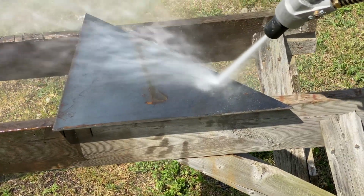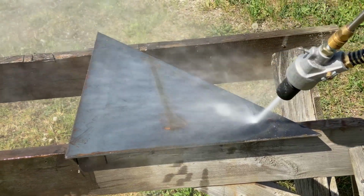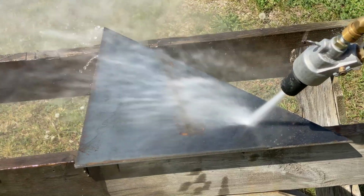So the abrasive particles get mixed with the water, delivering more abrasive action than if the blasting media had been used in an air-powered blasting gun with no water. So you get no dust either, and faster results. Pressure washer use number 3, septic system revival.